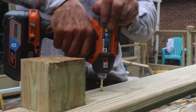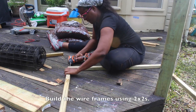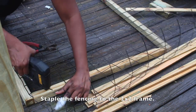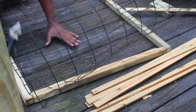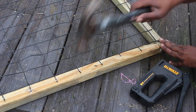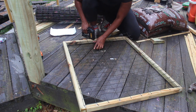One optional thing you could do to finish off the railing caps is give it an angled edge using a miter saw or a circular saw. Finally, we're assembling the wire paneling for the center inserts. To create the wire insert, I'm using simple 2x2 lumber and screwing it together. Then, using a staple gun, you want to staple the wire mesh to the frame and cut the excess wire. I then went back using a hammer and made sure I securely nailed the staples into the frame. As you secure the wire fencing to the other sides of the frame, you want to make sure that you pull it tight so that there isn't any type of sag in the middle.